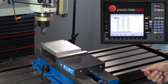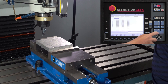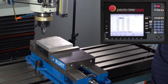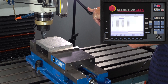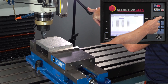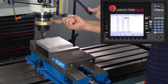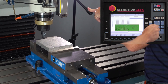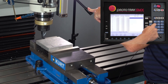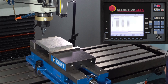I've got my first tool in. I'm going to bring it back over the top of the vise and on the control I'm going to tell it the diameter. This is a one-inch diameter tool. When I bring this down and touch the top of the vise, I simply hit the set key. You'll see that it has a number which is an offset showing the difference between the two positions. Hit it one more time to tell it the tool type — this is a finishing end mill — then lift it back up, lock it, and move it out of the way.